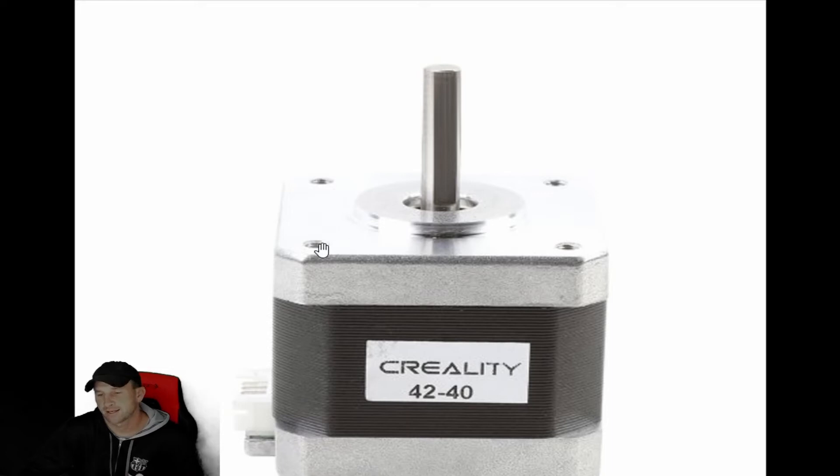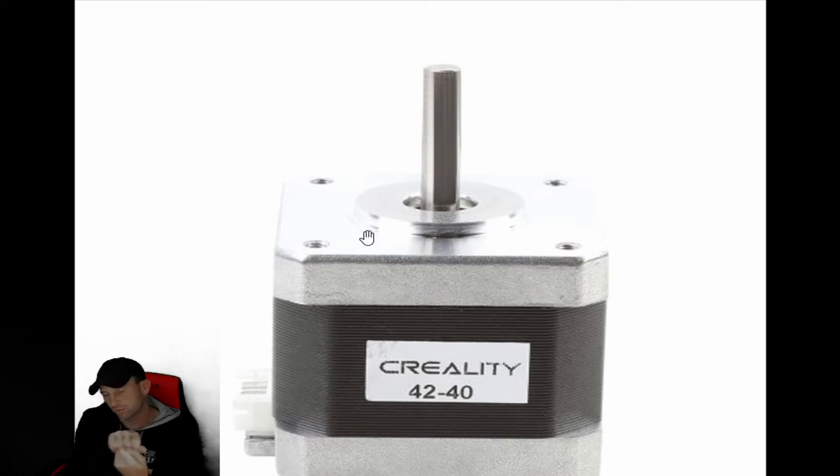What I mean by snug is: don't keep turning the allen key — just turn it a little bit until it catches and feels snug, and that should be sufficient. If they loosen up a little, you'd rather have them loosen than over-tighten, because over-tightening becomes a real issue.